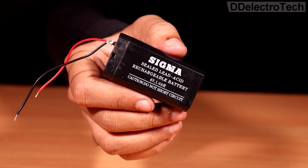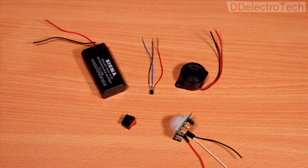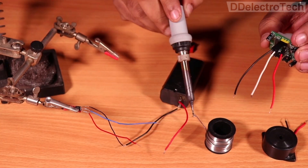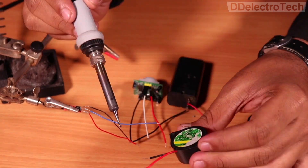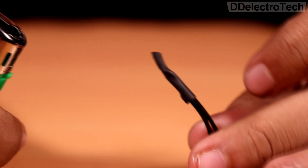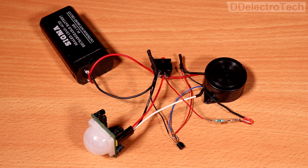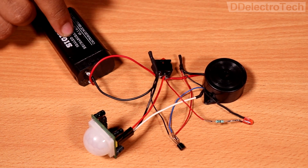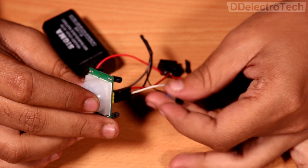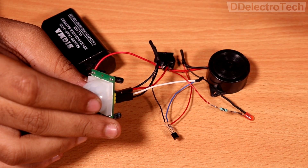This is the powerhouse of the device. Now I am connecting the circuit one by one, the diagram of which is given in the description. The battery is directly connected to the switch. The motion detected by the PIR sensor is signaled out to the transistor which will act as a switch and trigger the alarm and also light the LED at the same time.